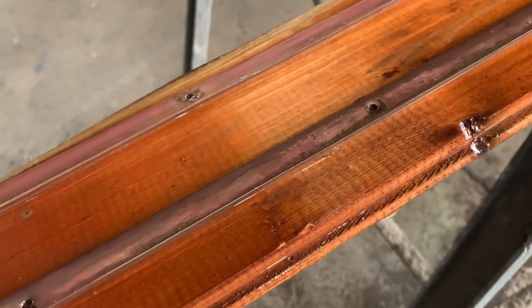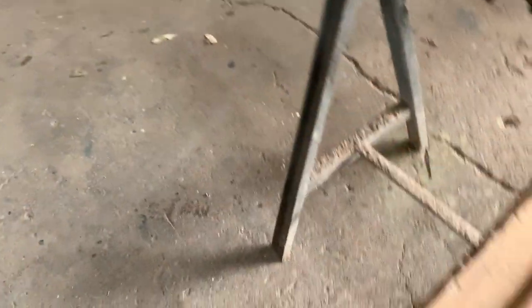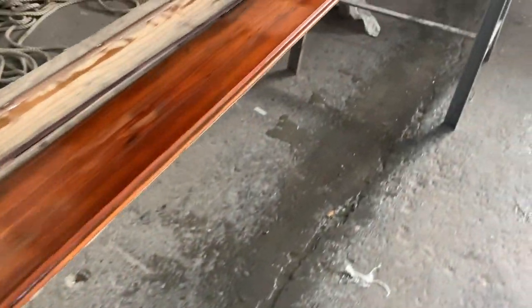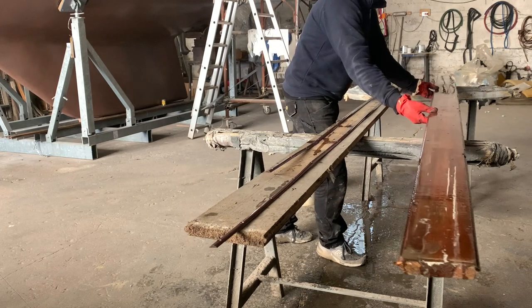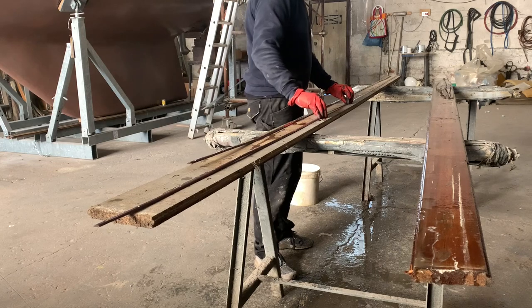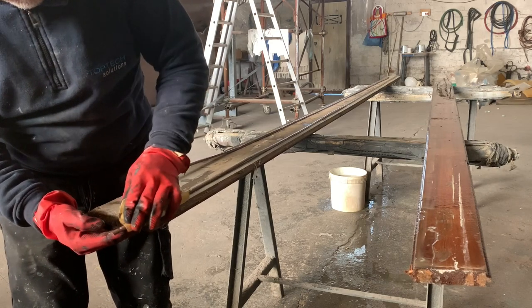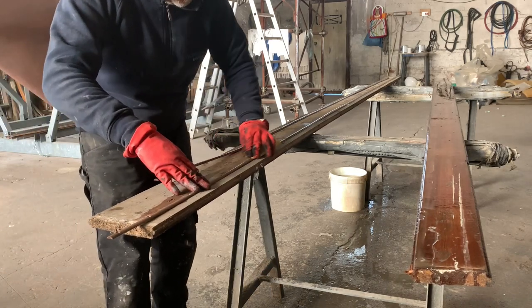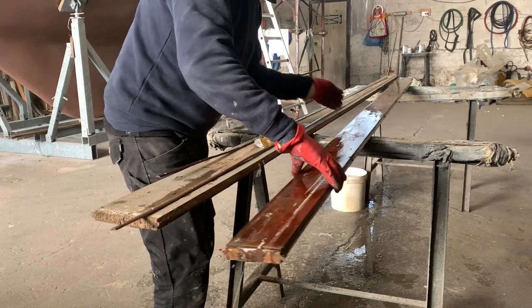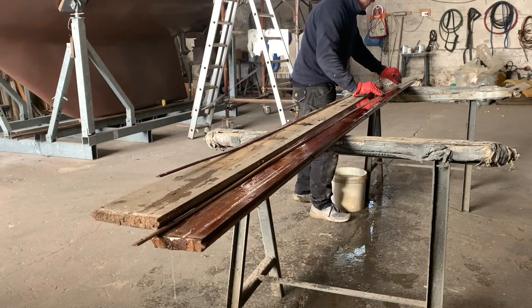You can see it's now more red, and after that I need to wash and shine. The color is quite red now but becomes yellow after sanding. You need to use some acid and after that rinse with water. Here we are — another moment of glorious sanding. In this case I use 320 grit sandpaper, and after that I will use wet 600 grit sandpaper before starting to polish. There are some imperfections that I need to repair and fix.